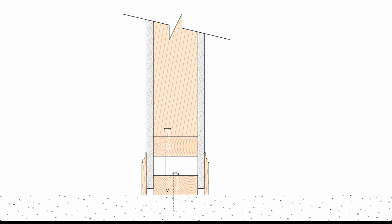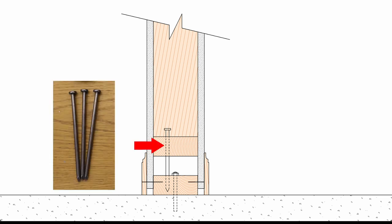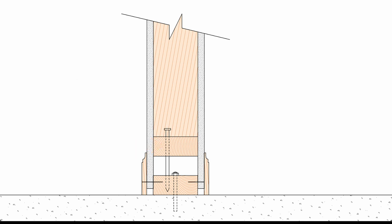The frame walls are floating above the treated base plates and are held in place laterally by spikes, which in my case are 60-penny nails, which are 6 inches long. Notice I do not have the spikes centered in this drawing because they would be hidden behind the drawing of my quick bolt. In practice, I install these on the centerline of the base plates.